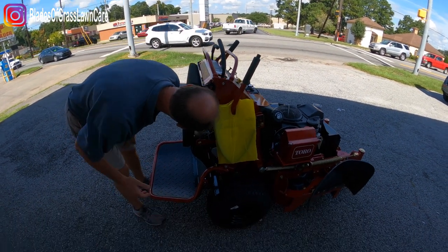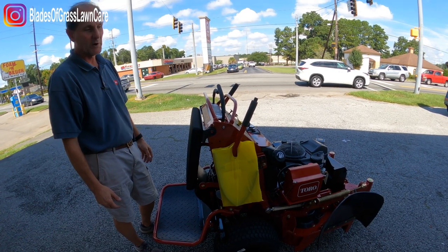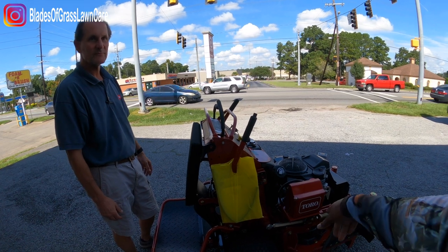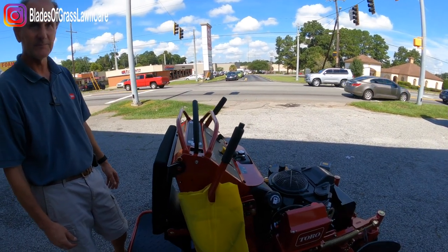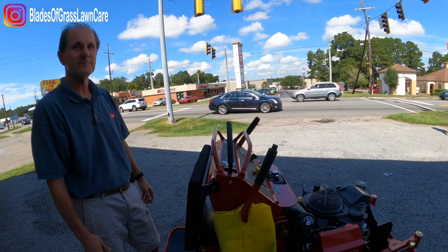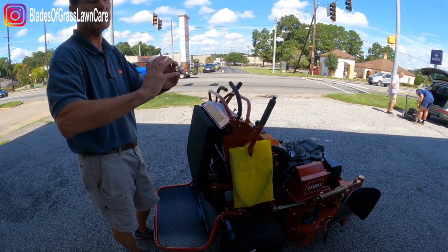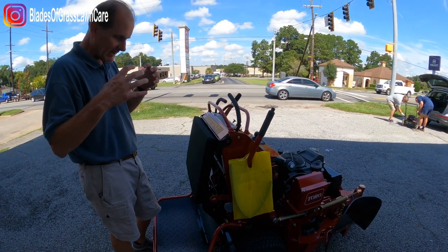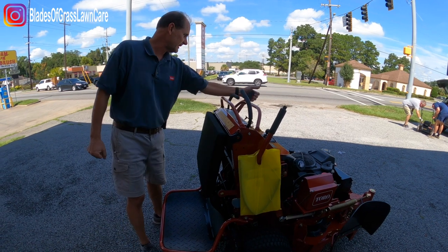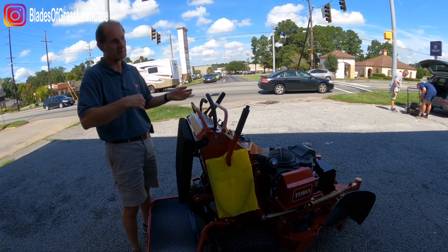Toro makes the other one too, but it's a simplified way to do the brakes. I have the Exmark 36 as well, and the 36 is the same type of brake and I love it. The Vantage also has it. But the new mower they make doesn't have that system and people have been complaining it's giving them a lot of issues. You can't clean out those brake discs inside the wheel without taking the wheel off — it just gets all the grass and weeds in there. It's a cable system with a lot of leverage, so something's got to give and it's going to snap the cable. Then they don't have any brakes and it rolls around the trailer and smashes it.